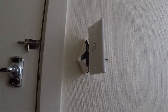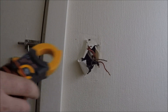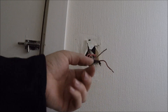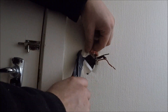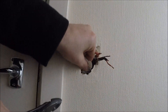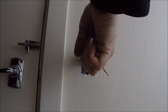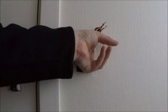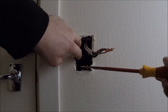That flush box in there is going to come out as well — it's an old metal one so I'll be ripping that out. First we'll get rid of the switch. For touching these, you might want to get a non-contact voltage tester out — this one's got a little LED that lights up red if there's power on it. These are terminated fine. Let's rip this flush box out. Get the sidecutters in there on a nice angle, squeeze them together and leverage the nails out bit by bit. I'm going to leave this box inside the wall and just remove the cables from it, then put a new plastic flush box in here. Fire it in, fire these screws in — sweet.